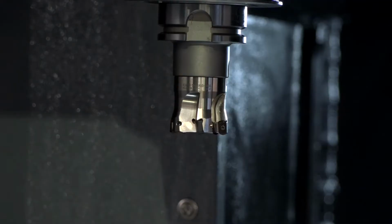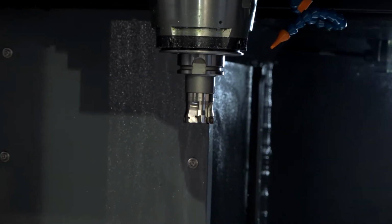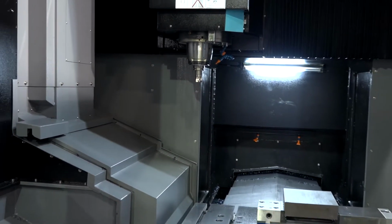So any small adjustments we make to any of the levelling feet, we can see exactly what's happening to the machine. Now, also I understand you're obviously installing the machines, but it can be used for other applications as well. Yeah, that's right. You can use it for setting jigs up, fixtures, CMMs, levelling parts. It's also got some vibration features on it for measuring vibration. So it's multifunctional as well.